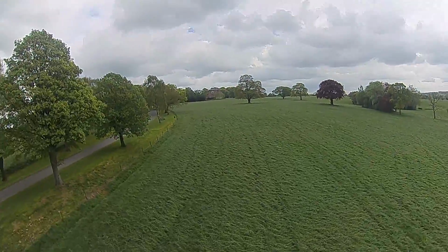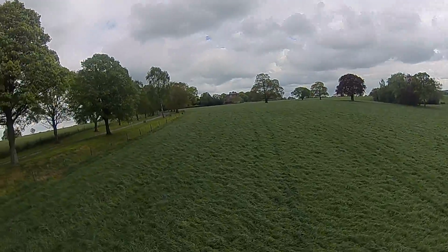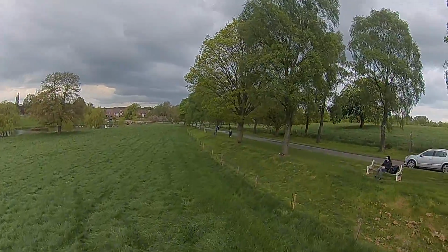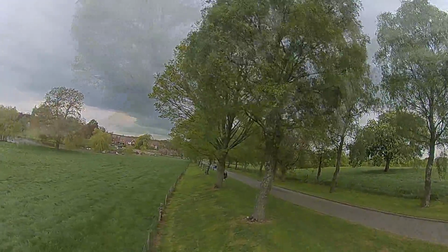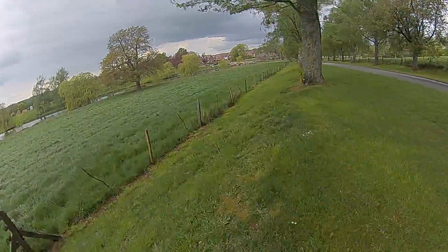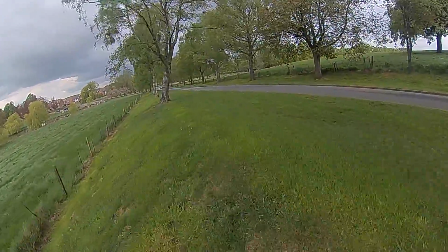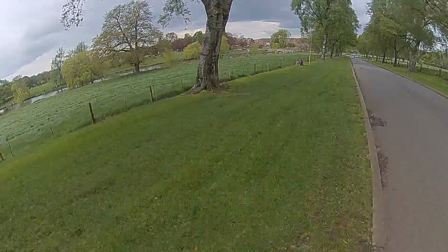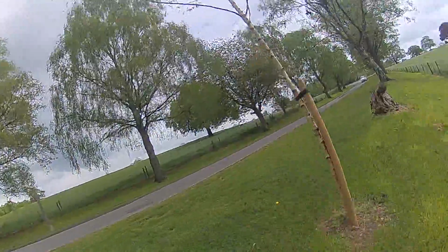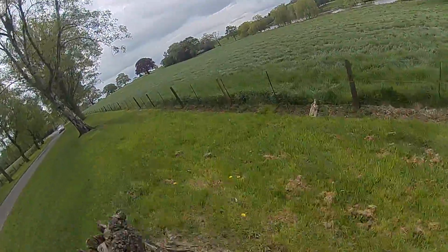Well, thanks to mobile phones, CMOS sensors are cheaper to produce and have a lower power consumption, and because of this they have a load of tech thrown at them now, where they are starting to surpass the CCD camera in dynamic range as well as other areas. However, rolling shutter and increased video noise is still a trade-off compared to the CCD technology.